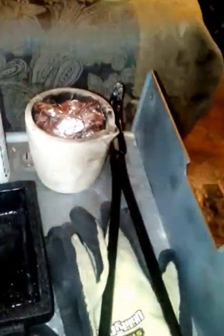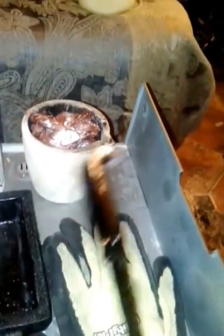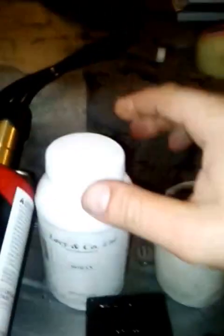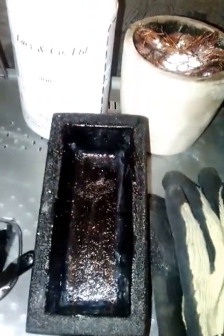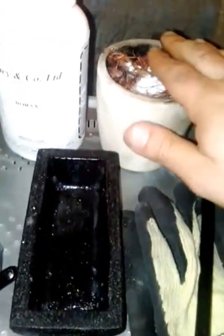You'll also want a graphite mold, a crucible, and a pair of tongs to lift the crucible so you can pour your metal into the graphite mold. Get heat-resistant gloves and safety glasses. To keep everything clean inside your crucible, get some borax. If you are melting copper specifically, also get some Vaseline petroleum jelly to put inside your graphite mold so the metal doesn't stick.